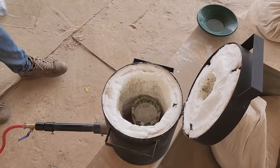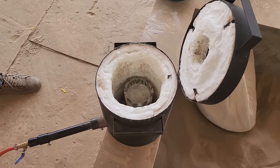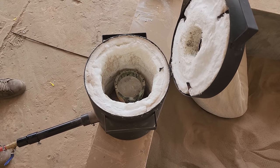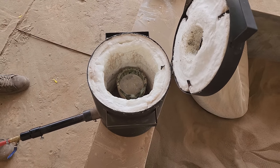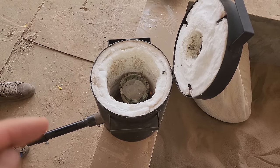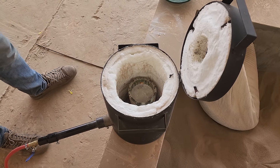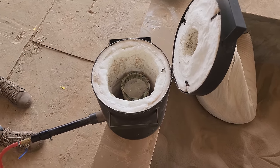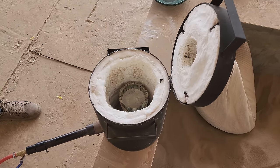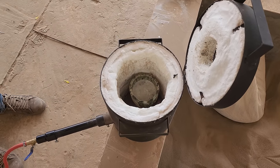All right, we're just starting our direct smelting test. This is going to be kind of a test of the process. We have 100 grams of concentrates, but they don't have much gold in them. Again, we're just going to test the recipe here. We have 100 grams of silica and 300 grams of soda ash, sodium carbonate. And this is just to prove that we won't get a matte layer. We want to test this out before we throw all our gold-rich cons in there and screw it up.